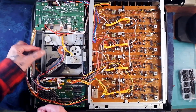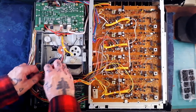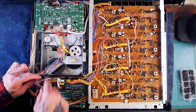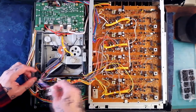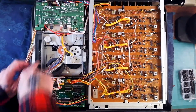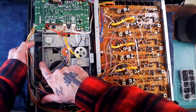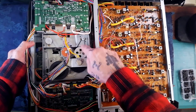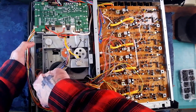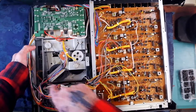You can just cut those cable ties with sharp scissors or a Stanley knife. Moving that out of the way, we can see there's one large ribbon cable coming from the transport here. You can pull that out by the strength of its own wires. There's also the little daughter board for pitch control — this is different to the 244. In there you can see two little trim pots for your fast and low speed.